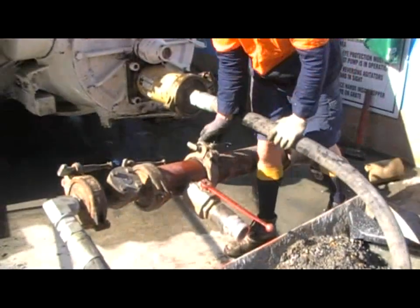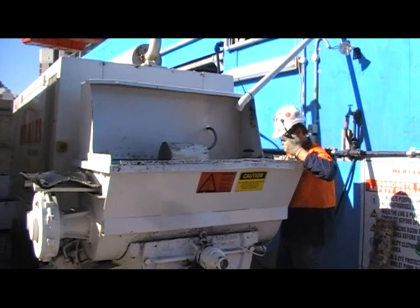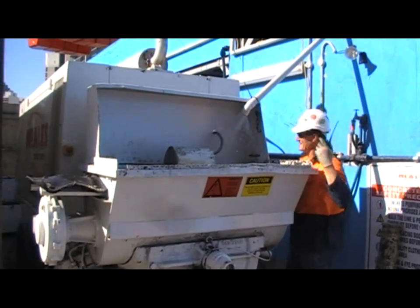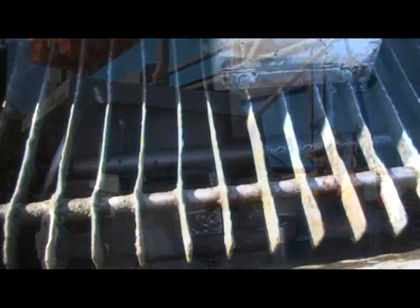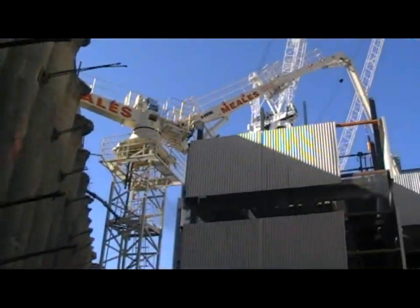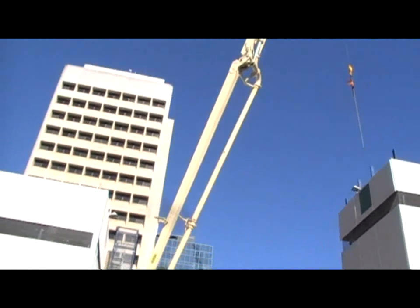Note that the clamps are now R-clipped. It is important that a good communication system is in use between the boom and pump operator. The hopper can now be filled from the recycling holding tank. You will notice that the water is clean — the concrete pump actually becomes a very large high pressure water pump. The pipeline and boom are now having the concrete pushed forward, and the concrete is directed into the pour to minimise waste.